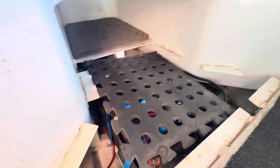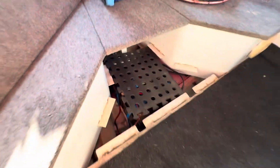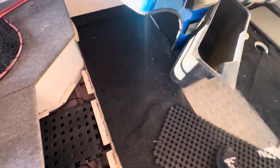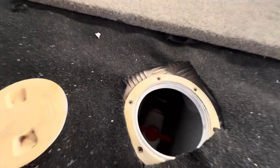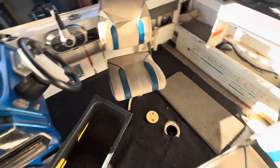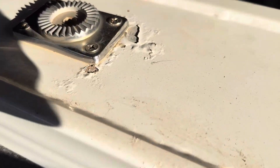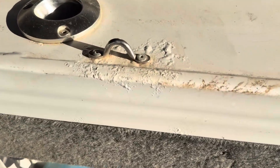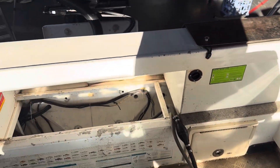Any fishing lures get kicked around and dropped in through these storage boxes — if anything falls down it goes inside the hull and you cannot get it out. In there there is dirt and debris that just cannot be cleaned out, and that creates our corrosion problem in the future. This boat has just started — every boat does it — it's just dissimilar metals playing with each other, not so friendly.